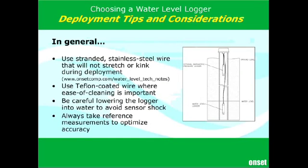This is the single biggest error if not taken carefully — if you don't have a good estimate, all the other errors could be relatively insignificant. When suspending your loggers, you definitely want to use a no-stretch, ideally stainless steel stranded wire. You don't want to use solid wire because after you pull the thing out and put it back in a few times it tends to get kinked, and any stretch in the wire would be falsely interpreted as a change in water level.